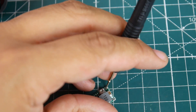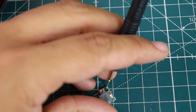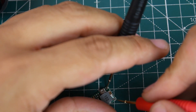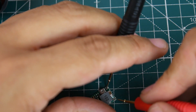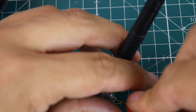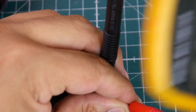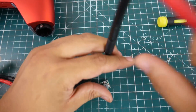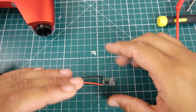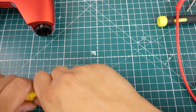There's a little screw on the regulator — it's basically a potentiometer that allows you to choose the voltage to output. Here's 'out plus' and 'out minus'. I've already set this before I started the video. 8.4 volts is a full 2S battery (4.2 volts per cell), so I have mine set to 8.36 volts — that's going to be perfect. Make sure you set yours to 8 to 8.4 volts output before proceeding to the next step.